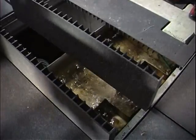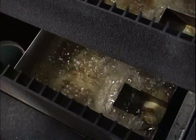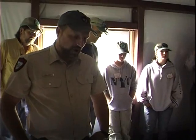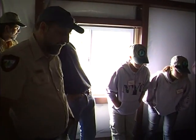The oxygen from that bulk tank outside is injected basically underneath the feet here into this tank. See the hose line there. And as the water percolates down through these channels in this chamber, it provides the most optimum efficiency use of oxygen being absorbed into the water that you can get.